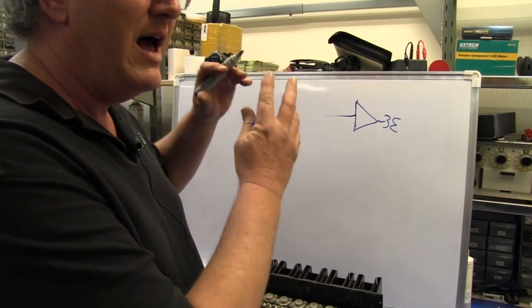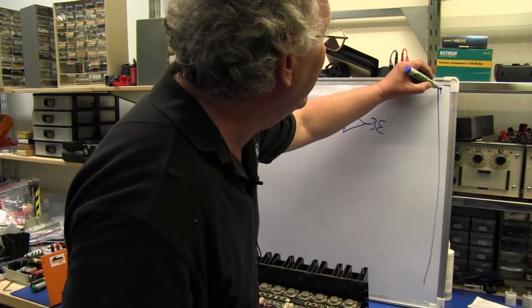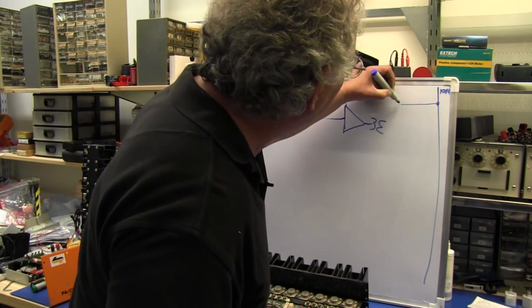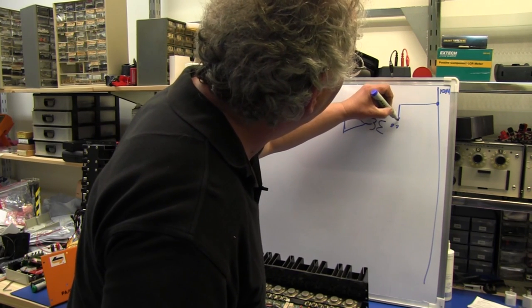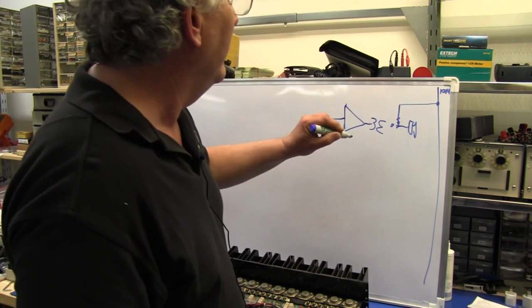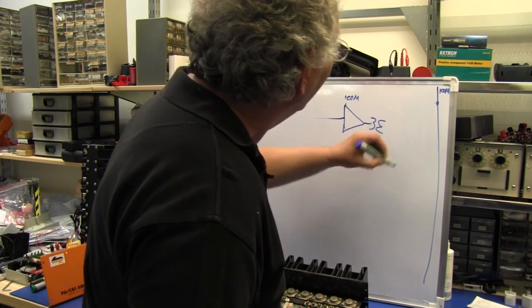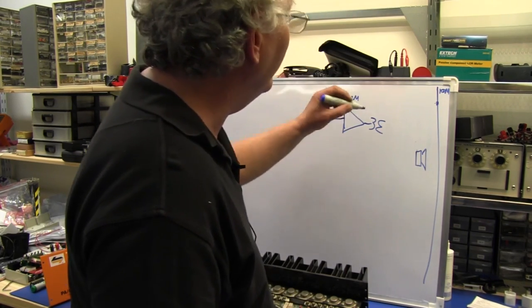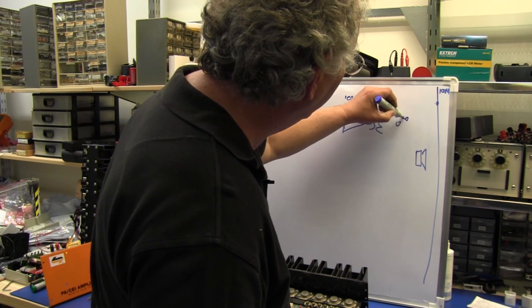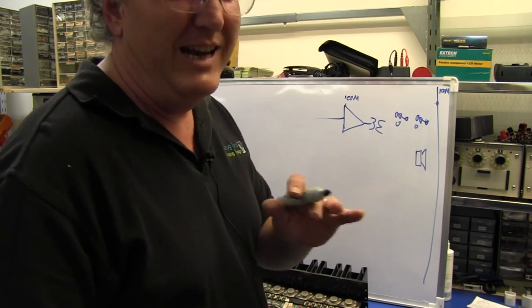Whenever the amplifier is unpowered, what we want is for the circulating intercom line throughout the train to be switched, I'll just draw a relay here. In the off state, we want it to be switched here to the local speaker. Okay. Doug's had a 20-year brain fart, folks. So we have here a local speaker in the crew compartment. We actually need two relays here. I'll just draw them in place and figure out what they do later. Doesn't have to be accurate. We can have stick figures.